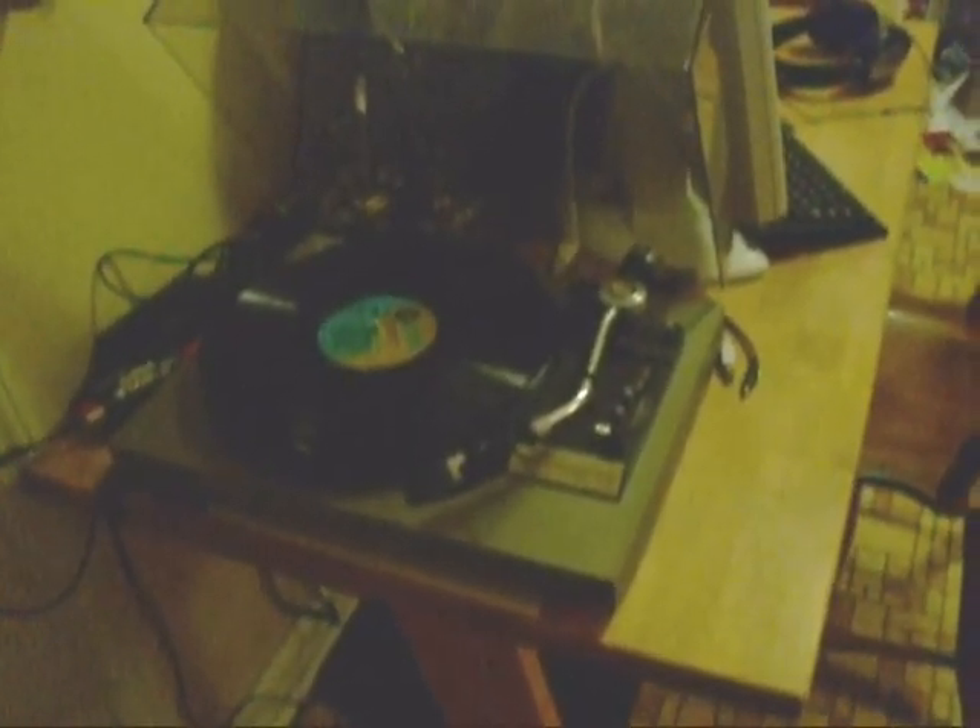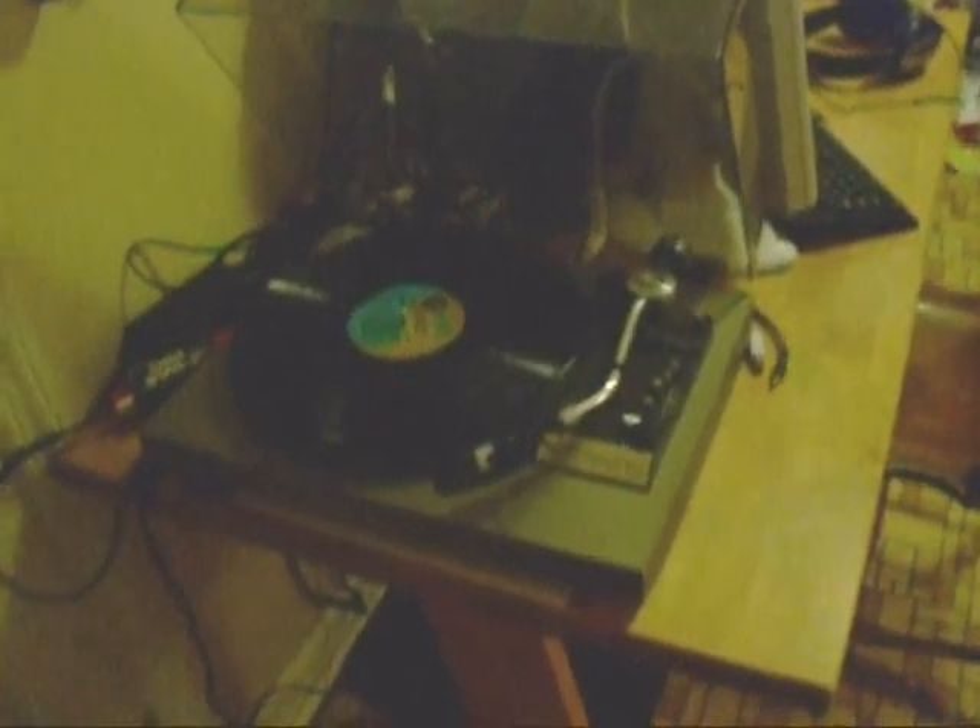Let's take a look at the equipment. First, the turntable — it's a Technics SL23 from the late 1970s. It was a nice quality turntable in its day, not very expensive but good. When I pulled it out of storage it ran all wobbly, so I ended up having to replace the electrolytic capacitors — they had dried out and gone bad. Once I replaced the capacitors on the servo circuit board inside the turntable it ran quite smoothly, and it's been running smoothly for some months now.